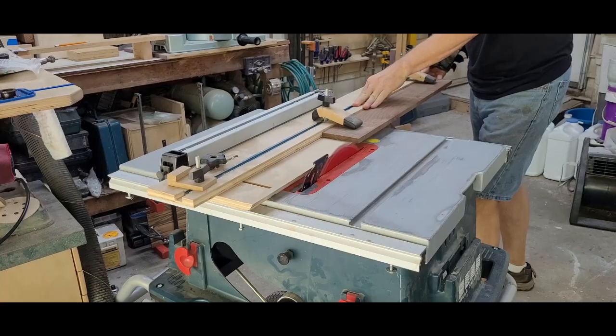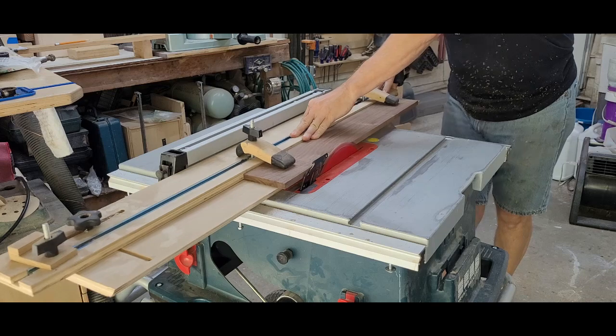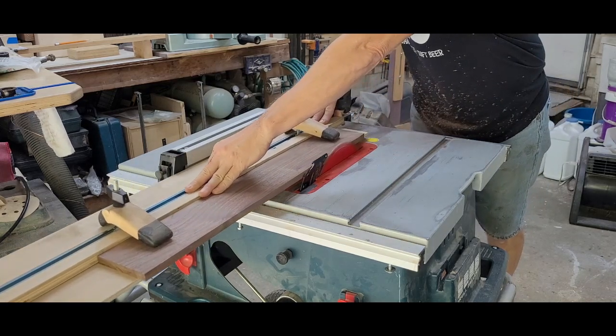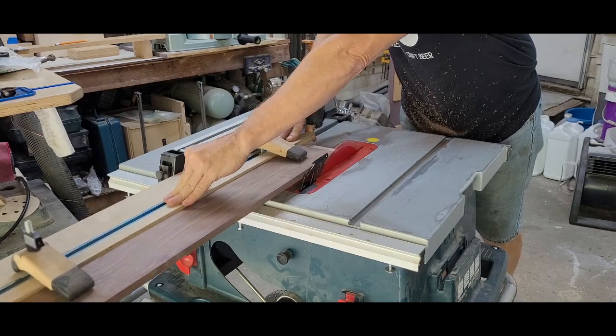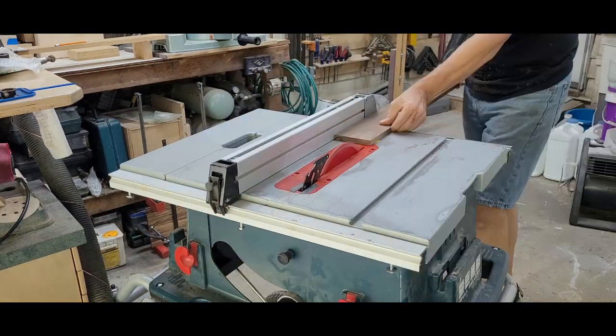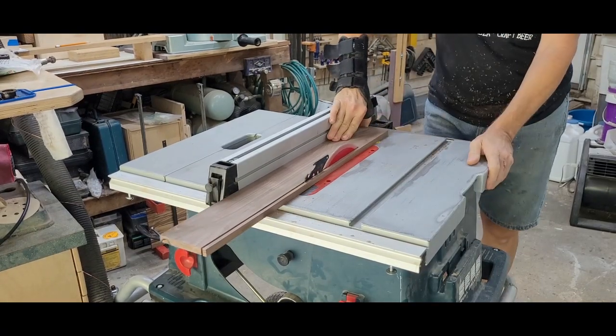While the panel was drying, it was time to start on the box sides. I had some walnut that was 1/2 inch thick, but the edges needed some cleanup. I started with my straight edge jig at the table saw and ripped the first edge straight. Then I reset the fence, ripped the second edge parallel to the first, taking my stock down to its final width.